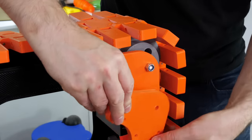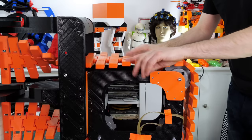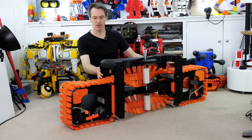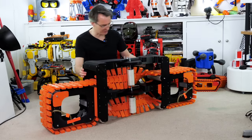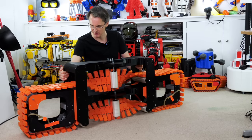I've just made another one of those orange tabs with the hole 10mm further out, and that just pulls the track a little bit tighter. Now we've got much more tension there — it's not all floppy and all over the place. It still might drag in the middle but we'll see how it goes. Well, it actually feels really bad — it runs for a bit and if I run it backwards and forwards I can kind of get through the jam, but it seems to be jamming quite a bit. I don't think it's in this middle section — it feels like the sprockets on the end.